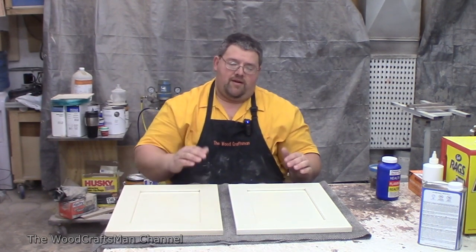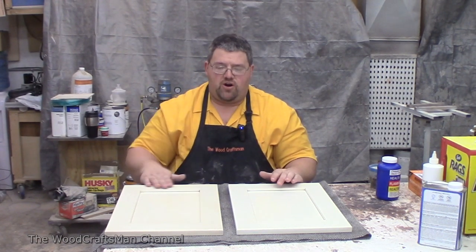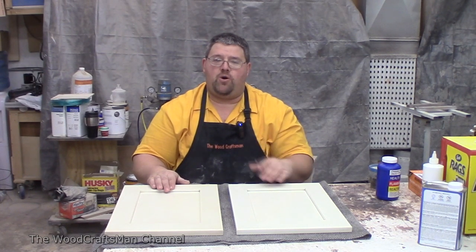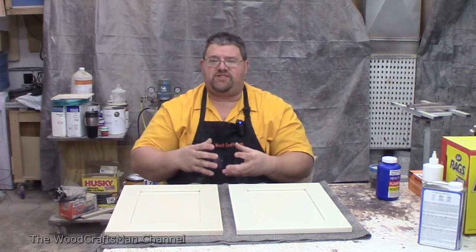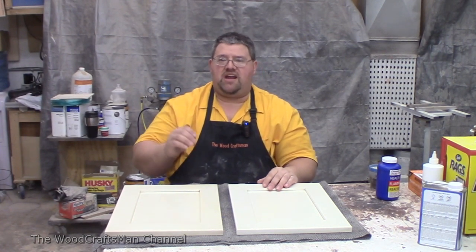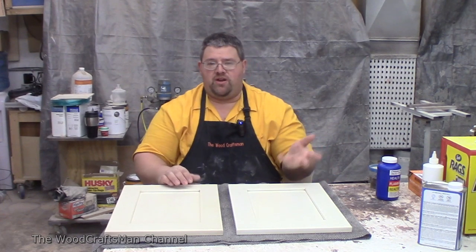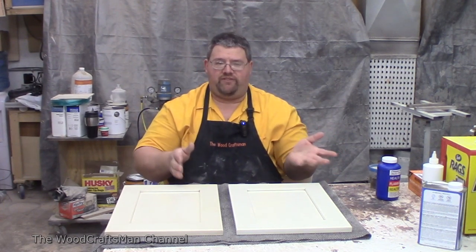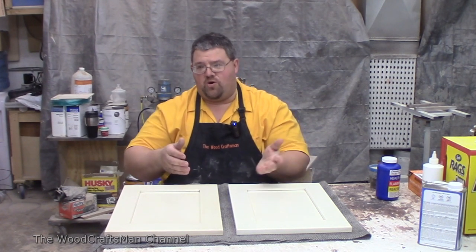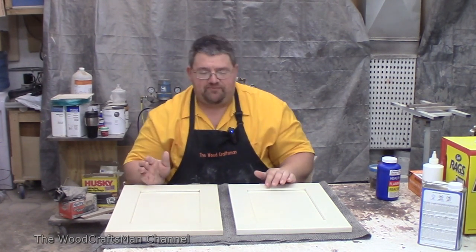Now my theory was the reason this door came a little bit darker was the fact that anytime you put a glaze over a pigmented coating, because of how the pigments form the film surface, the glaze stain was biting a little bit deeper versus if it had been over a clear coat. Now glazes in the shop here aren't new. We've glazed over vinyl sealer all the time. However, glazing over a pigmented coating might be slightly different. At least that was my theory.